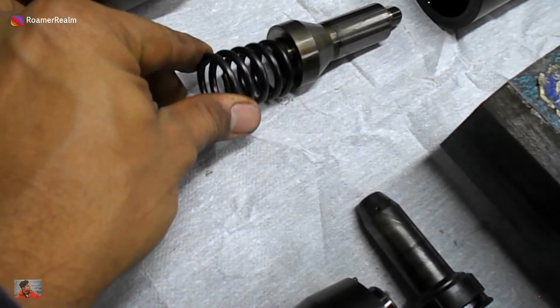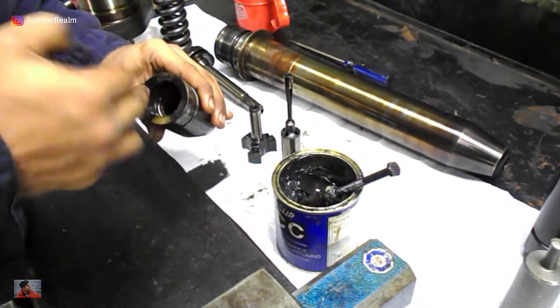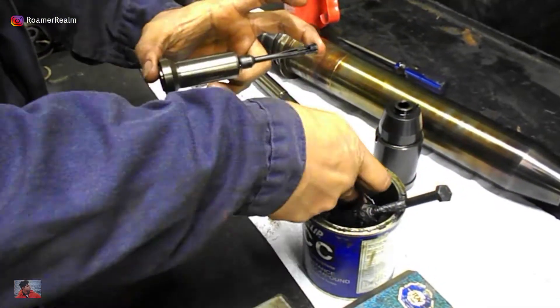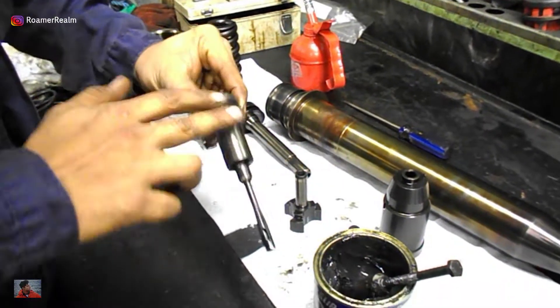The special tool is common and will also be used for the assembly of the nozzle valve with the cut-off shaft and the spindle guide. Believe it or not, on some ships I've seen people who don't even dismantle the non-return valve — they say it's sealed from the factory and cannot be dismantled on board. That is incorrect. It can be dismantled on board, and one definitely needs to dismantle it and inspect all the internal parts, especially the spring. Start with cleaning, inspecting and then lubricating the surfaces with moly coat and lube oil. All the internal parts should be interacting smoothly with each other and nothing should be stuck or hard to move.